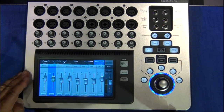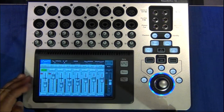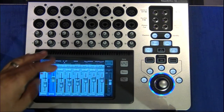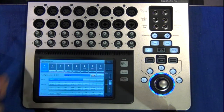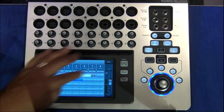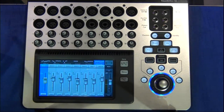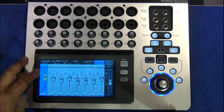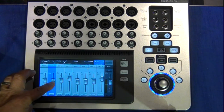One of the other great things about this mixer is just the amount of professional features. The TouchMix 16 has eight DCA groups. What's nice about DCA groups is I can go in and select, say, my kick drum and a couple of other items, and have them all controlled by one fader. All I have to do is select my DCA group, select the channels I want in that group, name it if I want — I could call it drums, whatever — and from that point forward I can control the level of all those assigned channels by one fader. So if you have a house of worship environment with 16 channels coming in and you want to make it easy for a guest person to do a mix, you can set everything up on DCAs named drums, keyboards, chorus, whatever you want, and control all those individual channels via one fader. This just makes life a lot easier.